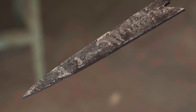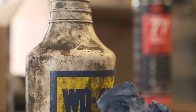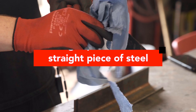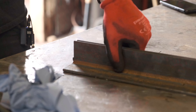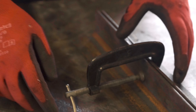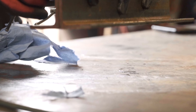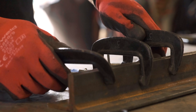You can see that from the colour on the surface, but we don't need to worry about that. So now we'll clean this off — we'll clamp it between two pieces of steel and put it into temper. Just going to clean it off, mainly so it doesn't stink when it's in the oven tempering, and also so it doesn't stick to the steel we're going to clamp it to. Just to make it nice and straight, we'll stand it in here spine first. It's only a very minor warp so I don't need to put any shims in there — just enough to pull the blade straight and in line with itself. Not too tight. And it will just pull the blade in line for when we temper it, and with a bit of luck come out completely arrow straight and ready to grind.